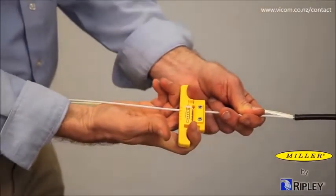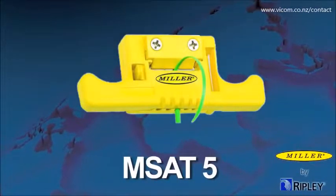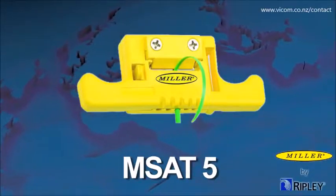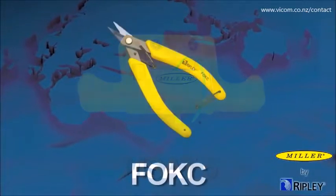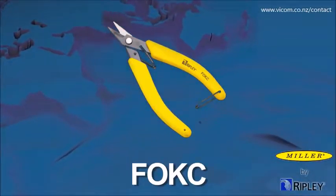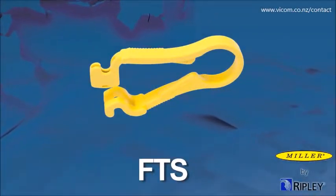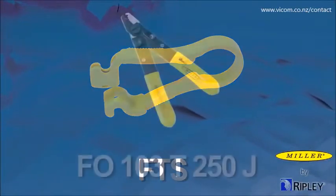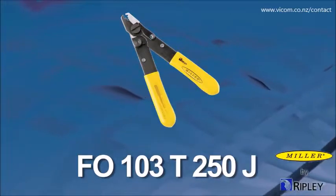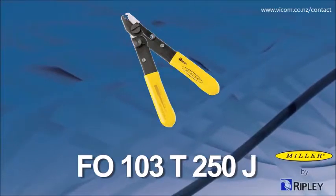Ripley also offers accessory tools for further preparing the cable. The Miller MSAT 5 mid-span access tool allows for easy access by shaving a precise opening to prevent fiber damage. The Miller FOK-C fiber optic Kevlar cutter can be used to cut Kevlar strength members in the cable. The Miller FTS fiber tube scorer can be used to end score the buffer tube. And finally, the Miller FO103T250J tri-hole stripper will remove the 250 micron buffer coating.